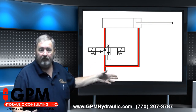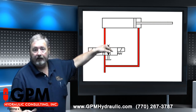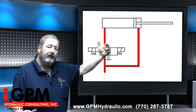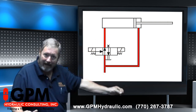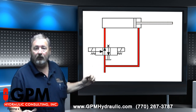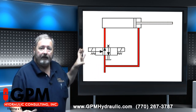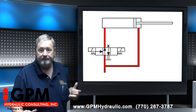So when I energize the A solenoid, that will shift the directional valve into its A or straight arrows position. That will direct flow from the P port out of the A port into the piston side of the cylinder. Oil that comes out of the rod side is directed back to the pressure line where it comes back into the P port of the directional valve, joining the flow to the piston side, giving us a greater flow rate and extending the cylinder very rapidly.